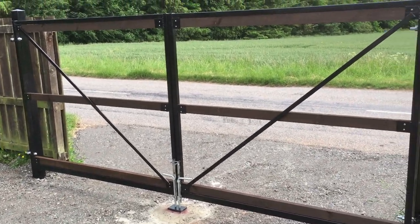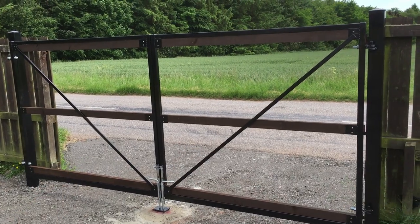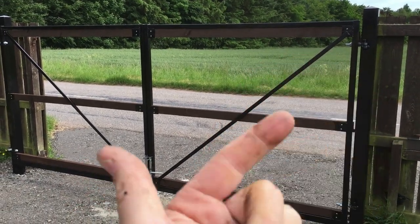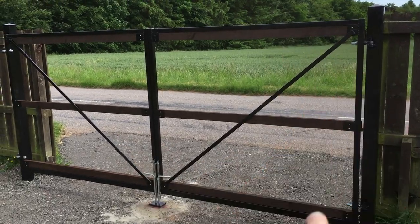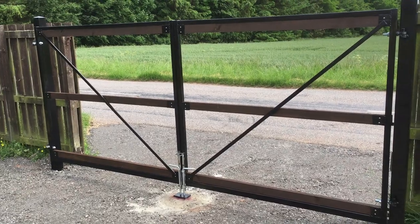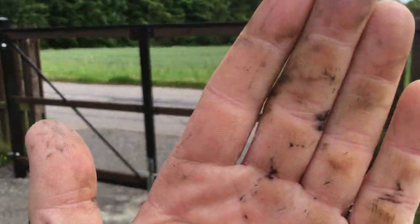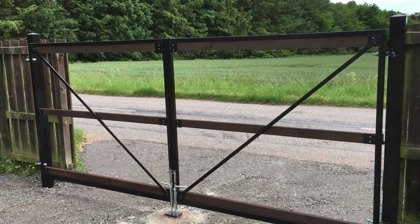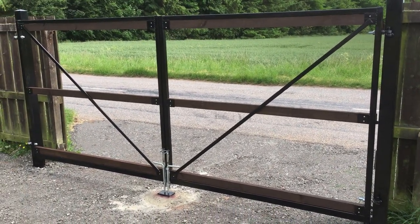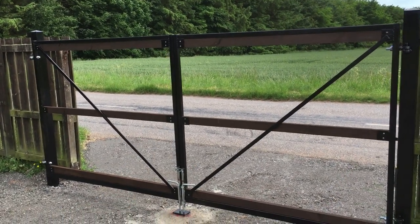The beauty of doing it this way is that putting the slats on is really easy — it's just like installing slats on a fence. You butt them on the outside, use a nail gun, and just nail them on all the way along. The reason I've done it this way is I really couldn't be bothered using self-tapping screws and drilling into the gate frame — it's far quicker and easier to nail them on.